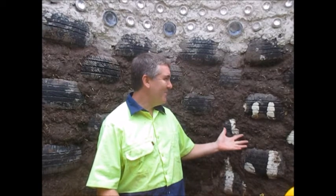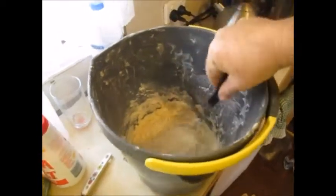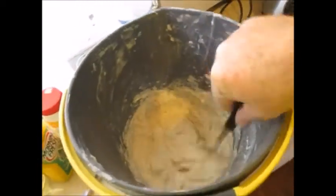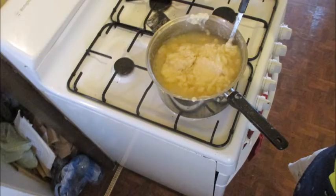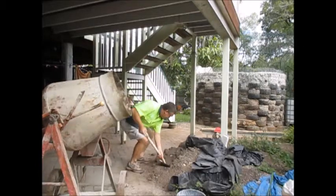Howdy, my name's the dude and we've just finished doing some mud brick plastering here on the earthship. I thought it'd be a great opportunity to do a how-to video. First off is the flour — this acts as a sort of binder for the whole concoction. I mixed it up in a bucket: 0.66 of a kilogram for a barrel load, added a bit of water, then put it onto the stove to bring to a simmer, then brought it downstairs where we've got the mixer going.